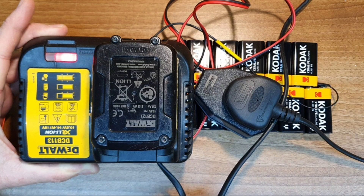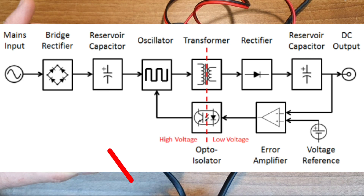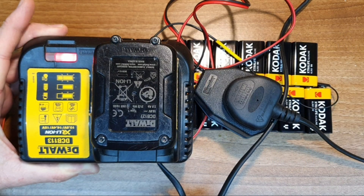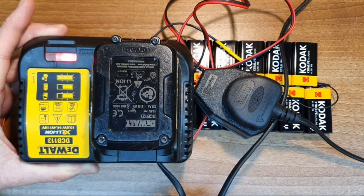So why does this work? In the past, this would not have been possible because a lot of our appliances would be powered by transformers, and transformers require AC to operate — they cannot operate on DC. But they have been replaced by switch mode power supplies, which take the AC, transform it into DC, and pass it through a bridge rectifier. This also means that if you put DC onto the mains terminals, it passes straight through the bridge rectifier anyway, and inside it operates on DC anyway. So I think for a small off-grid system, like a log cabin, it's unnecessary to use an inverter. Since the devices run on DC anyway, why should you make AC just to convert it back into DC again? The inverter has its own energy losses in the conversion, so you can skip that step.